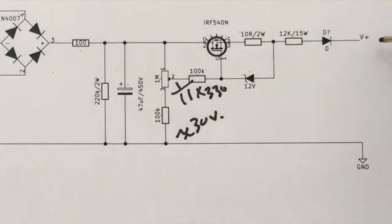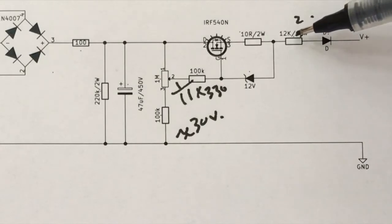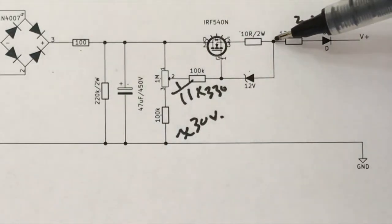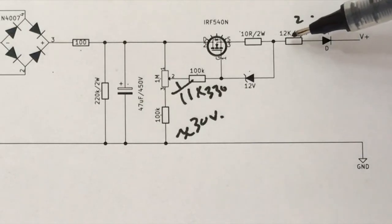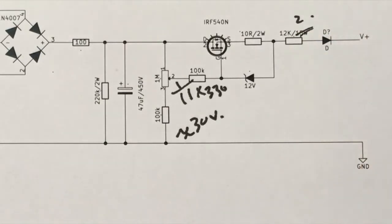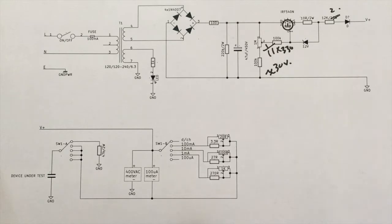This 15-watt rating — I'm not worrying about that. The reason is I've used the 2-watt 12k and as I described the power rating has to be much higher, but when I detect a short I will be at low voltage, so I'm not getting 330 volts shorted to ground — it's going to be a much much lower current than 30 milliamps anyway. This diode here is to avoid a charged load capacitor on this end. When I drop this voltage, if the voltage on the capacitor is higher than the output voltage, I don't want current to flow back — so that's a blocking diode, a simple 1N4007 or similar.